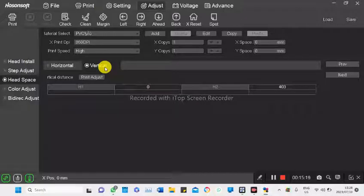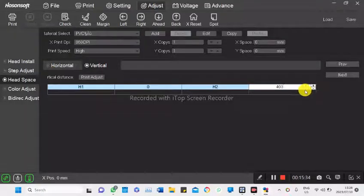So when you print adjust, you check your scale, the number corresponding most close to the straight line of white in between the black marks. That number that is corresponding there, you adjust plus or minus that value and you save and print adjust again.